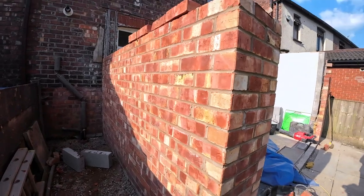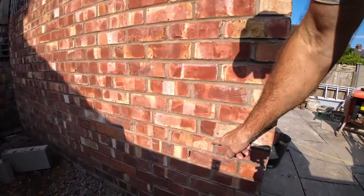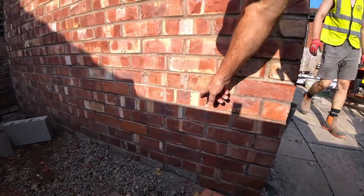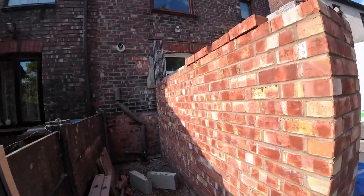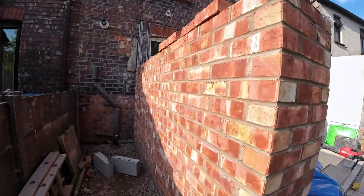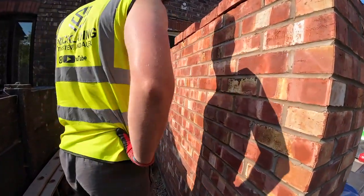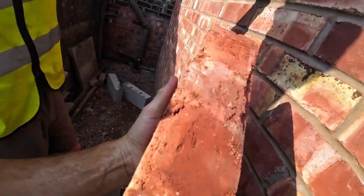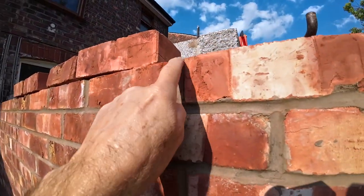There's yesterday's little bit of brickwork. We started here. And these are discontinued. I'm thinking you'd agree they're quite a good match then. They're an excellent match, to be honest. And they weren't the worst to set either? They were tough, because they're dry, extra super dry. So you have to joint every course. And don't forget your perps, which we did.